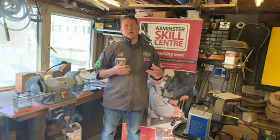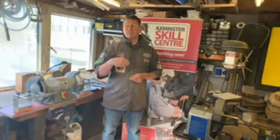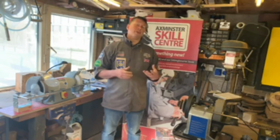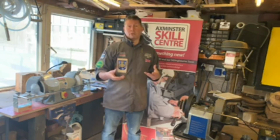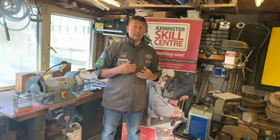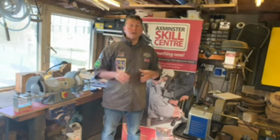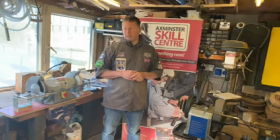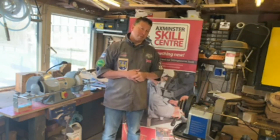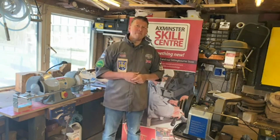But now modern jigs and some of the modern sharpening devices mean that we can get that more perfect grind every single time. And when I say perfect grind, I mean the aesthetically good grind, the one that looks good, single facets all the way around, or double bevel if you need a double bevel for internal bowl cutting, or double bevels on skews. It's all very easily done on jigs, and it condenses my 5-year apprenticeship of learning how to sharpen down into literally about 5 minutes.